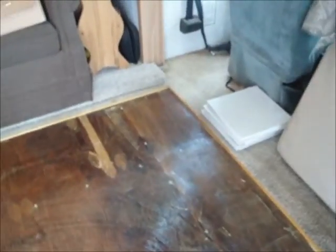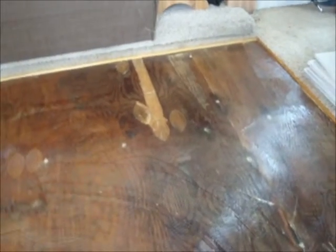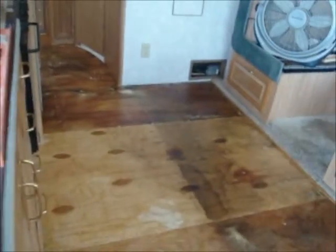I'm going to start over there in that corner — I have to start there, that's the way I laid it out. You can't see my lines, but I can — there's one right there. I'm going to start basically one tile out from that corner and go that way with it, come this way with it, fill it all in, and get it going that way. And then all these tiles along here will be cut, and all the tiles along the wall and around the cabinet and everything, that'll all be cut in.